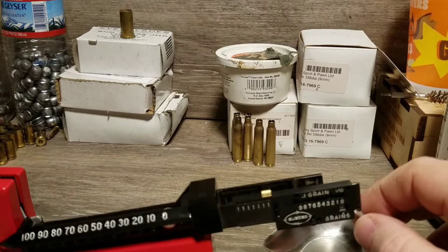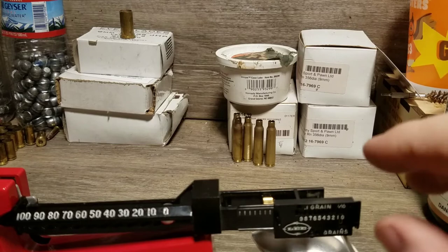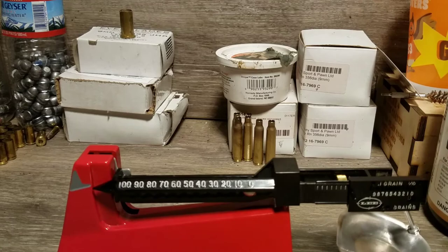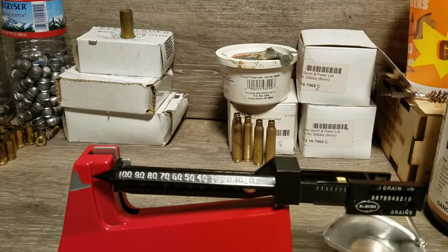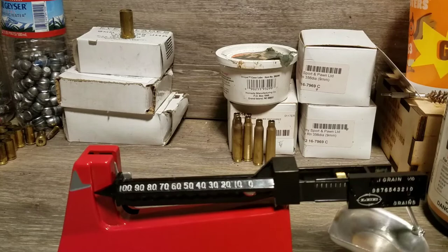Now I've got it set at zero and I have to hang the pan on it. You can see it came up and moved but then just stopped — that's not what should happen. When I put it back on I didn't center it, so it's hanging on those magnets. I need to move it a little bit to get it in the center. If I bump it you'll see it oscillating, which is what you want.